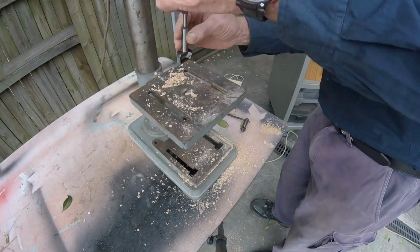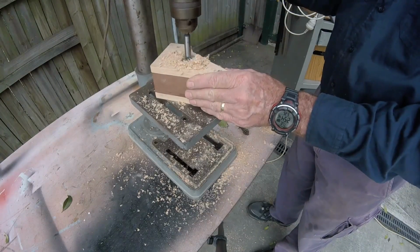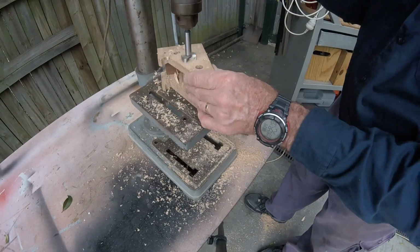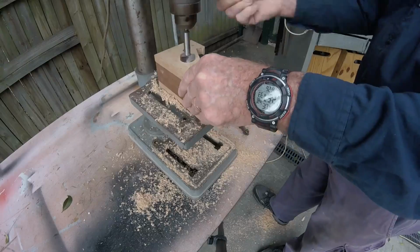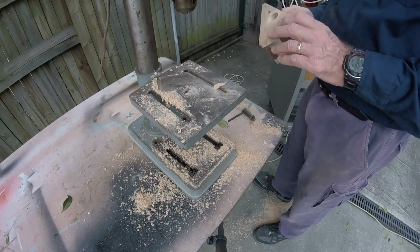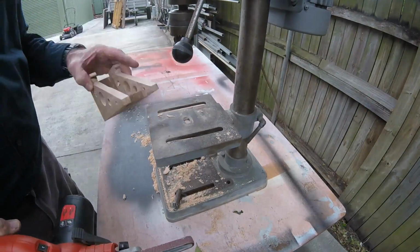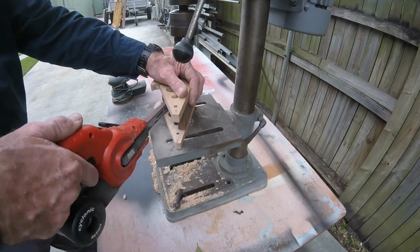Now, ideally I would have thought of this change before assembly, but I didn't. One of the downsides of Tasmanian oak is it really likes to splinter. So just about every hole splintered on the backside as the drill went through the wood. I will have to live with the splintering, however the power file came in real handy for smoothing the inside of the holder and getting into places that were hard to reach otherwise.